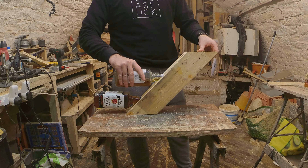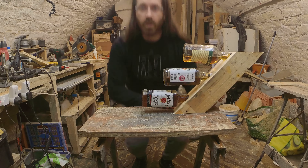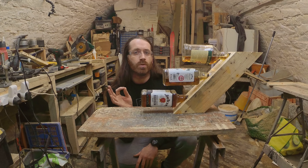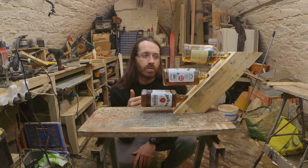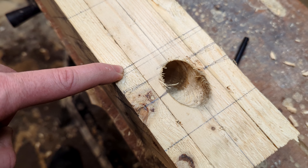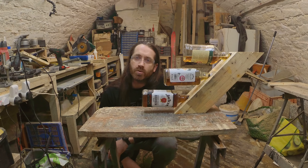It stands up on its own. The holes aren't completely straight — when you look from the top, all the bottles are actually slightly skewed. Measuring and lining the holes up, I made a huge error. In my head I was thinking I was just cutting circles because I had a circular drill bit, but when you're cutting at an angle you're actually drilling an oval. That's why the top hole got very close to the end of the piece of wood. I made a couple of measurements and it still didn't quite work out right, but I am as close as I need to be.